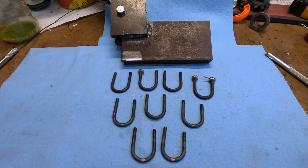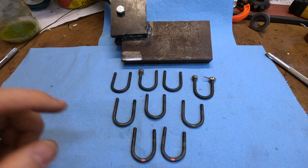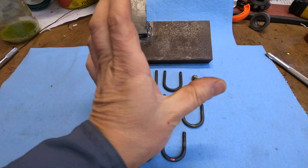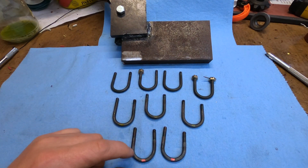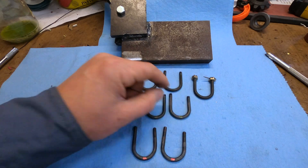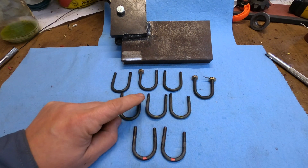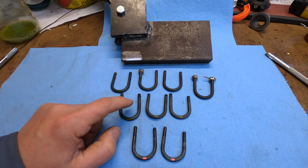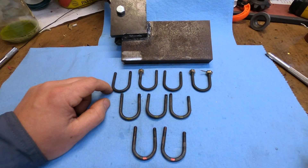So that's the process I used. I used two lengths of material for initial forming testing. I had a different jig I tried to use at first — a tool for the arbor press to press down into a V block with a U shape in the bottom — and I could not get consistent leg lengths with that. So I ended up heating those and straightening them out and using them as a first test on this fixture. Then I made three more to fine tune the exact placement of the bend for the leg lengths. The customer wanted a couple that aren't necessarily to finished spec for their own fabrication and testing purposes, so I gave them all of those as well. The final four at the top are within all their specs and tolerances.